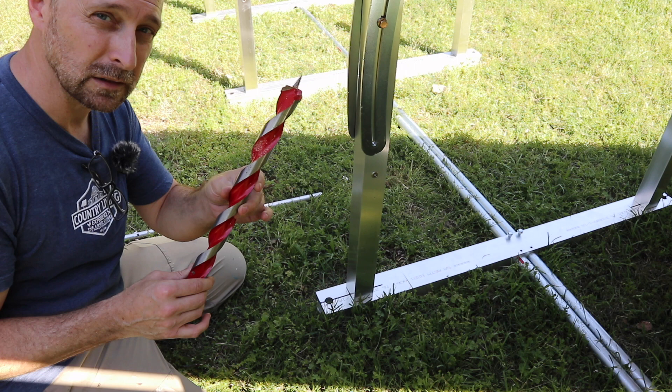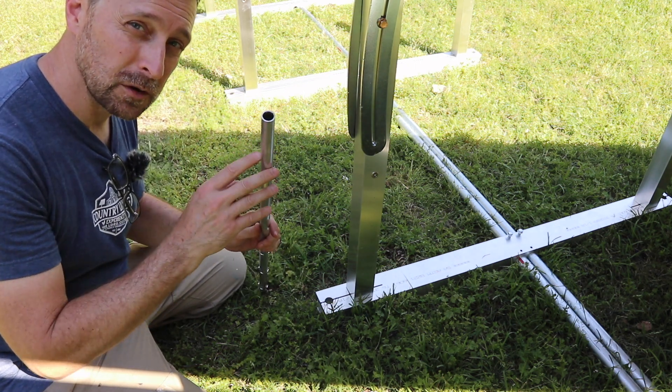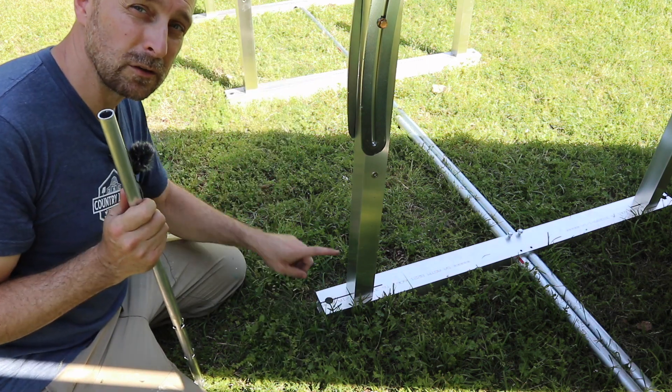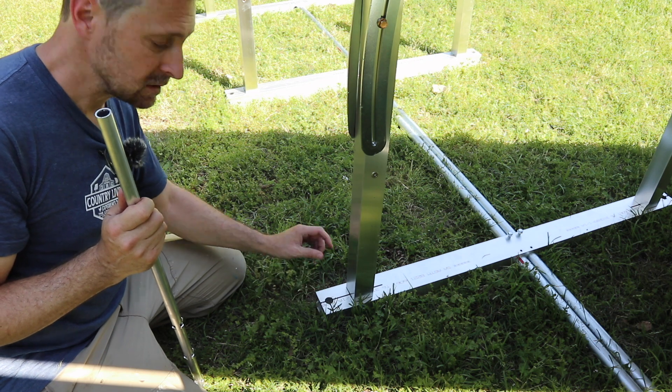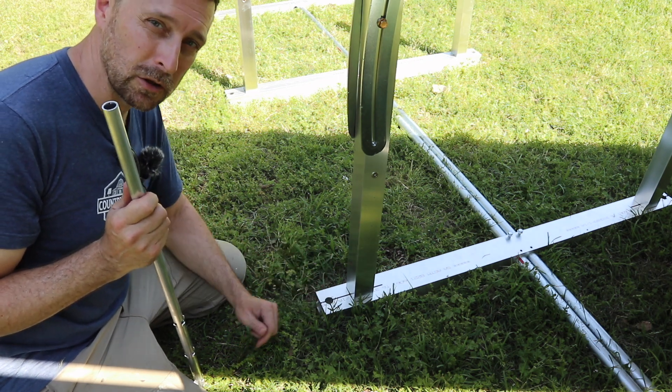You are going to drill down about 18 inches, and you're going to need a masonry bit — you should not use a wood bit. Your bit should be a half inch wide. Once you've drilled down completely, pound the spike into the ground, leaving about four inches above the ground so it comes through your bottom tube and sticks up a little bit more.